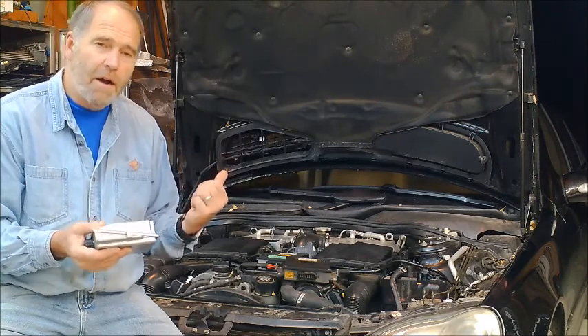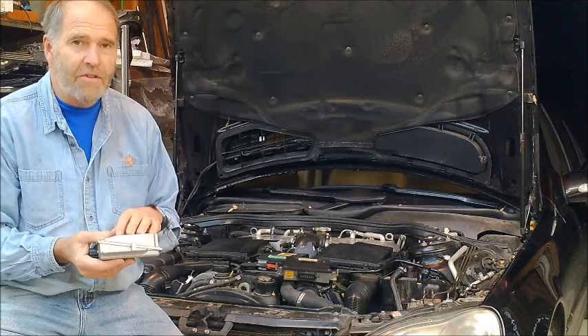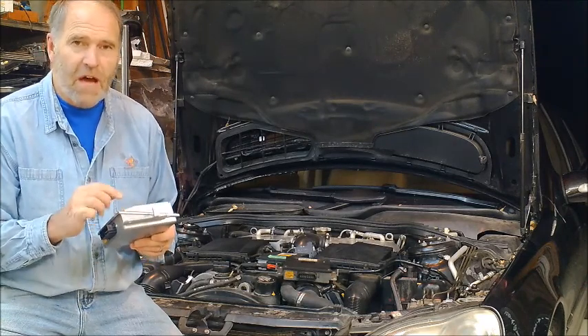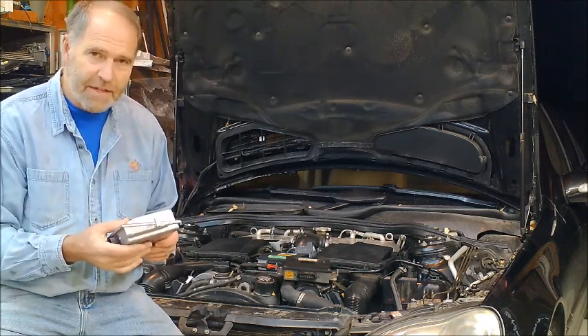In the car here, there is no circuit breaker. So if you've got any kind of a short on the coil pack, it feeds back into this unit, finds the weak link, and blows it. And typically when these things blow, it's not one component - it's four, five, six different components as the current has ripped back through these things and taken them out.